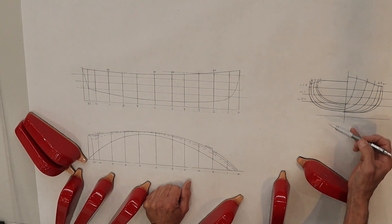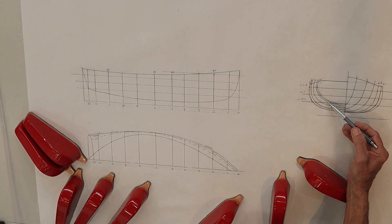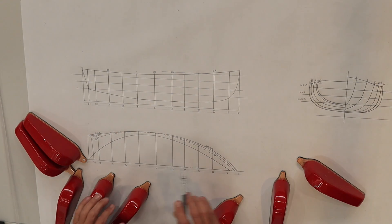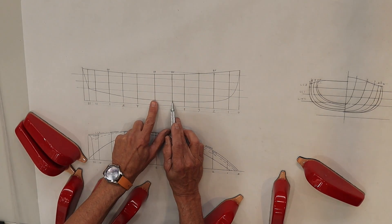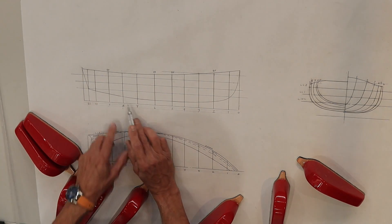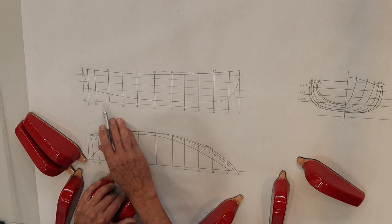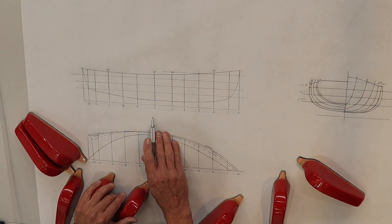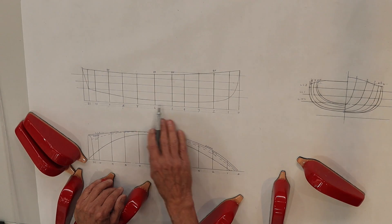One of the things you might notice is that a lot of times when you look at drawings like this, the station marks will be more uniform. The reason they're not that way on this is because of the way we had to move these two bulkheads that are going to be where the center seat is. So you can see this space is a much different spacing than some of the others. Typically where you're putting molds in, you would have all station marks a uniform amount apart, but because of the circumstances for Steve's tender, this is what we're going to end up with.